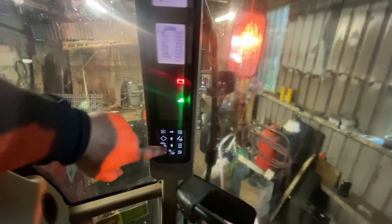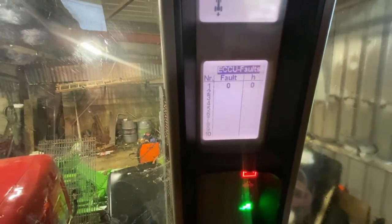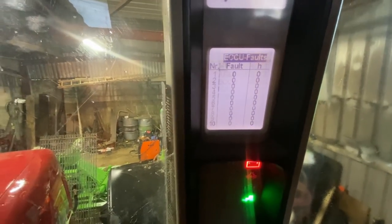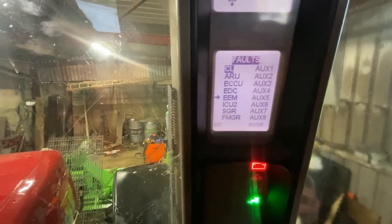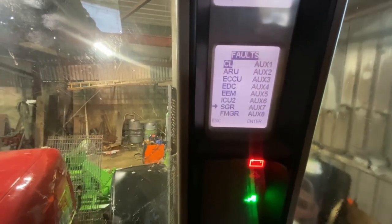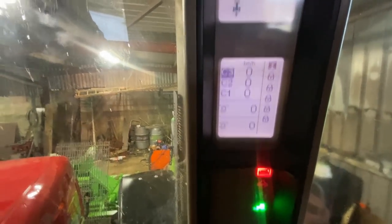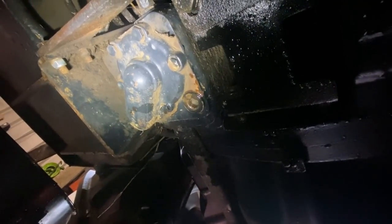I never bother checking the ARU unless we get an ARU error. I check the ECU, EEM, and SGR. We'll press the down arrow to bring the lighting down and press enter — B is your enter button. We're holding no ECU faults. We'll check our EEM — holding no EEM faults. Check our SGR — holding no transmission faults. FMGR is the last one — holding no faults there either. So that's all good: no errors on the tractor.